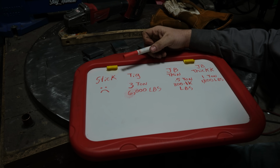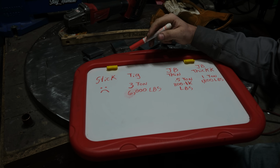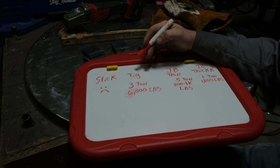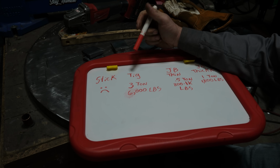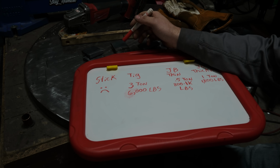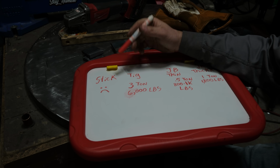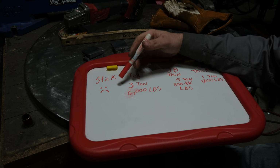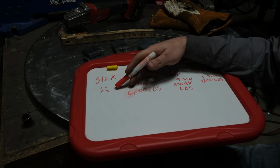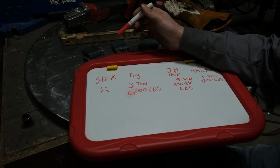Well, let's talk a little bit about the results there. I got to say, I wish you guys were here to help me find where that TIG weld went, because it blew under the welding table and was sitting in a place I couldn't see it, and I looked for it for 10 minutes before I found the bastard, so I wish I had help. Anyways, stick weld, atrociously bad, and I kind of expected that. I wish I had 3/32 rods, and I can tell you right now, had I run an equal length weld with a 3/32 rod at maybe 60 to 90 amps, it wouldn't have failed at zero pressure. So that's really more or less an issue with the fusion, but it may be a whisper, but we'll give that a big, ugly fail, a frowny face. That's not a good weld or a spot weld. So that lost, but again, that's more me and my situation.